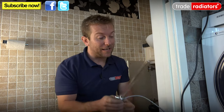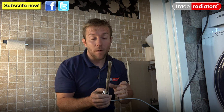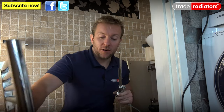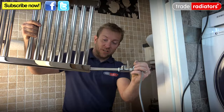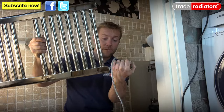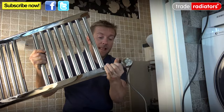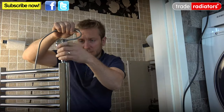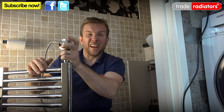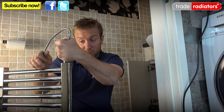The next thing — and it's a very good idea — is to get your element screwed in and the manifold on your radiator before you put the radiator on the wall. Purely because the element is quite long and if it's already on the wall you're not going to be able to get it in. So I'm going to pop my element in — as you can see it just slides all the way in. I've put a little bit of seal on there but there's already a rubber seal on the manifold itself, so really it's just a matter of twisting it in. Do not use the body of this to twist it in — grab yourself a set of grips, tighten it up and get it pointing in the right direction. These have got a little rubber O-ring on them so this should go in nice and easily and seal up nicely. But if you're worried, just get yourself a little bit of PTFE as well to make a proper watertight seal.